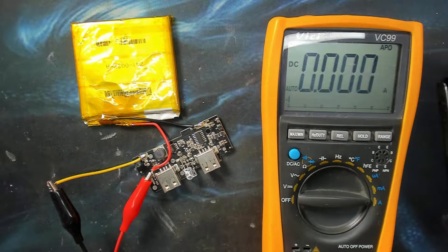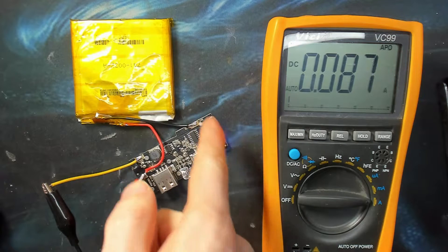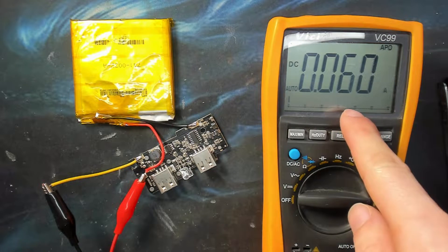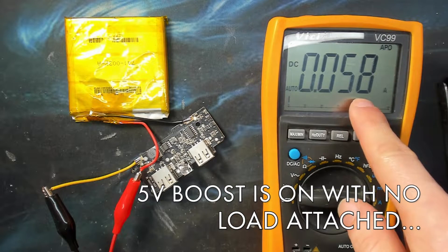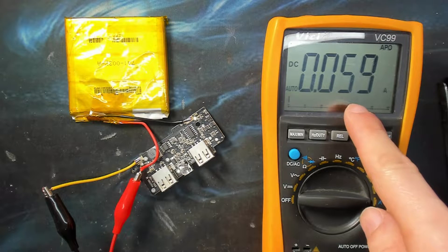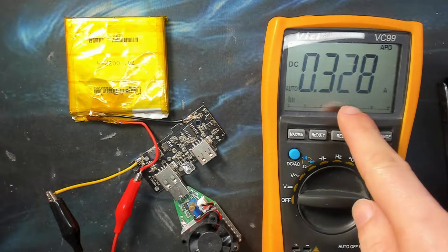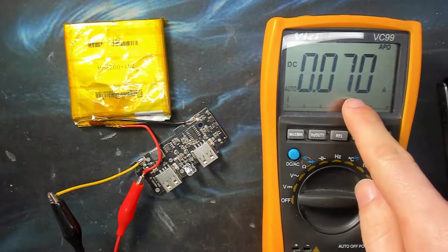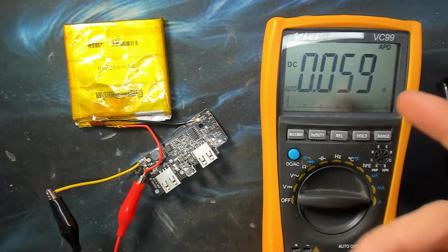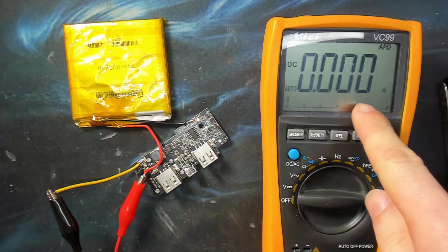Here's another setup. Let's turn on the multimeter - so far so good, we've got nothing. Pressing the power button triggers the power meter on it. The LEDs on the bottom have gone out, we haven't even attached a load, and we're sitting at 60 milliamps. That's an order of magnitude higher than the previous one. Let's plug in a load - there's our 300 milliamp-ish load. Let's unplug it again - the lights have gone out and we've dropped back to 60 milliamps. Let's just wait and see if that drops into standby.